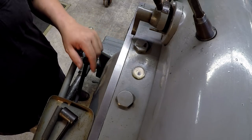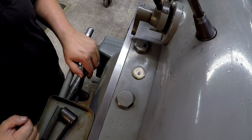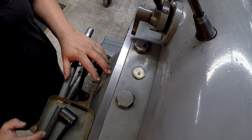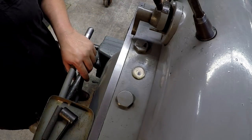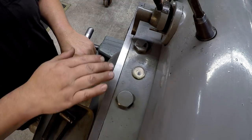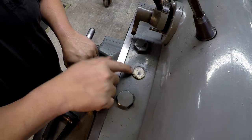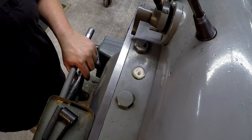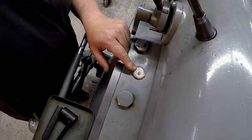So I had a lot of guys suggest that I should prime these things, that I should go ahead and fill them with oil. But I don't want to do that because the machine is not bone dry. I didn't take this apart and wipe it all down, so there's still oil in here from the last time it ran. I want to turn the motor on, watch all these sights fill up with oil, and then go from there. The one on the cross rail and all these up here.